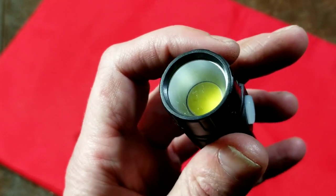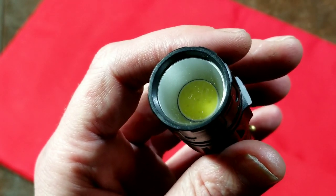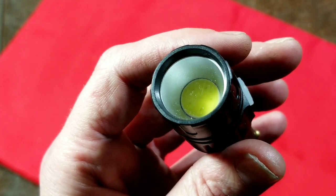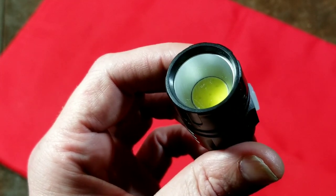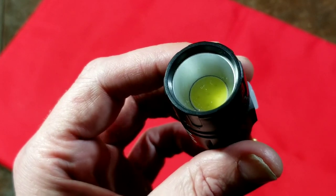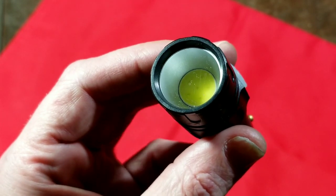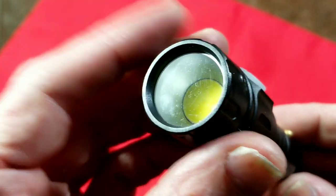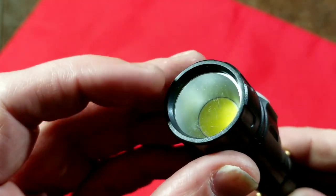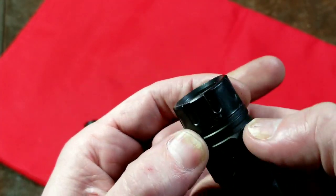The Harbor Freight uses COB technology — chip on board — which is multiple LED cells on a single board. Inside you can see six LEDs: one, two, three, four, five around the edge and one in the center. Contrary to popular belief, LEDs don't actually emit white light — they emit blue light, and the yellow tinge you see is a phosphor. The blue LED interacts with the phosphor to produce white light, kind of like a fluorescent lamp. Because it's not a single element, it doesn't focus well, making this more of a floodlight with a very wide beam.